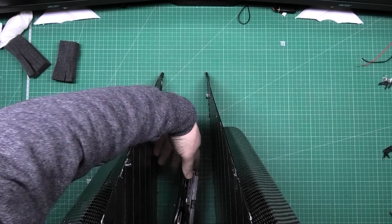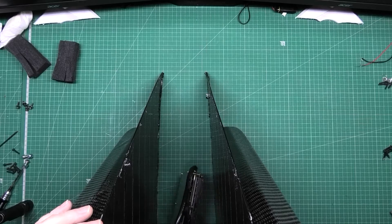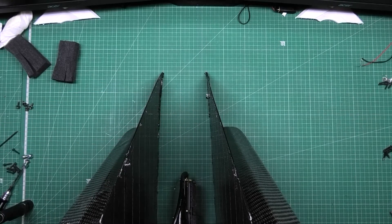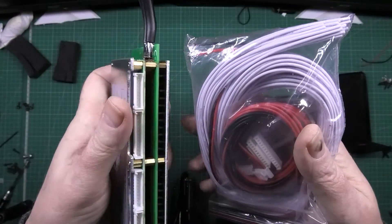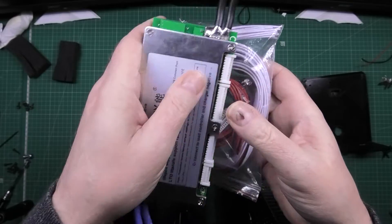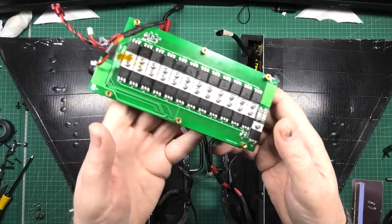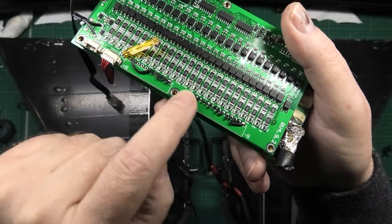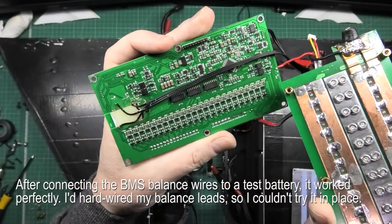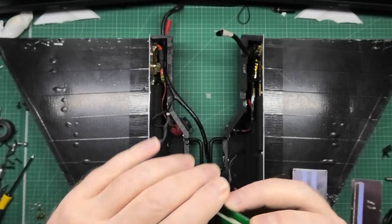I've checked the voltage on the battery — I've got 74 volts, so the BMS is definitely toast. I hardwired all the cells in. The new BMS has different connectors, which are locking type connectors — one of the problems I had was they kept coming out. I've had to completely strip the whole battery down. Here are the two halves of the battery and the BMS. There's nothing obviously burnt anywhere on it, absolutely nothing, so I don't know why it isn't working.